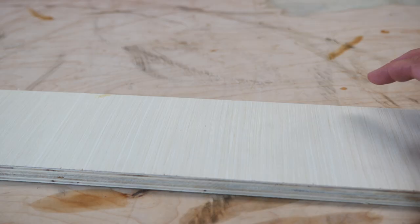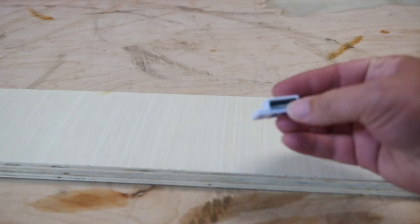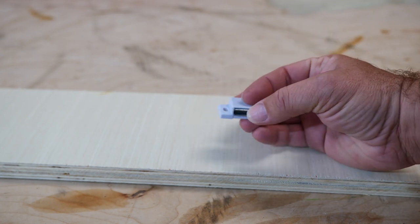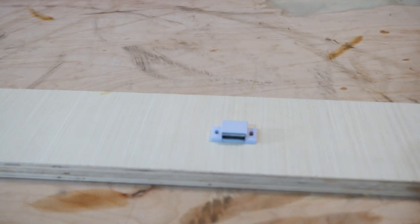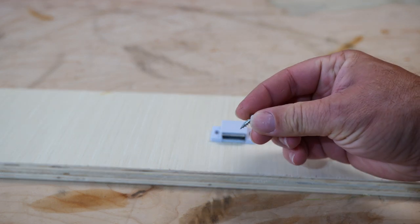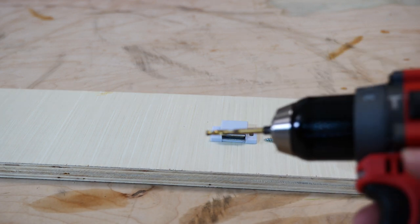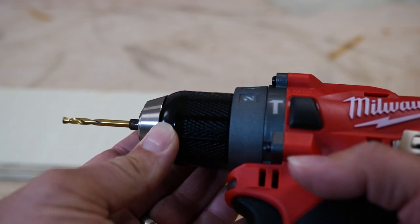Let's say you've got a piece of three-quarter inch plywood — maybe this is the side of your cabinet — and you want to attach a magnetic catch to that. The magnetic catch is made out of plastic, and if you torque a screw down onto that, you're going to crack that plastic. I'm going to be using these really short screws, which again, if I use too much power on the drill, it's just going to strip these out, and I'll demonstrate that. You may want to pre-drill this, but I'm not going to for this purpose.